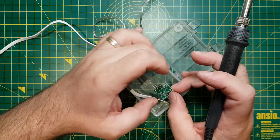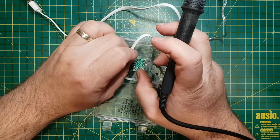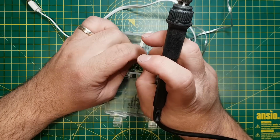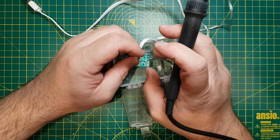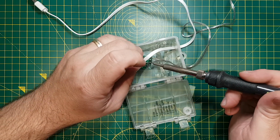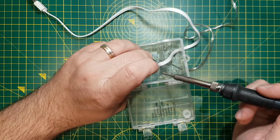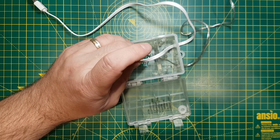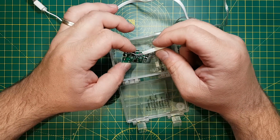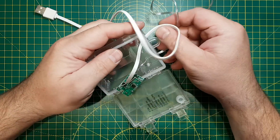So I'm assuming that the microcontroller has a tolerance, so it'll have a voltage range. Some of them work from 2 AAs, and they work from rechargeable batteries, so they obviously go down to 2.4 volts or less, but equally they work just as happily on 5 volts.